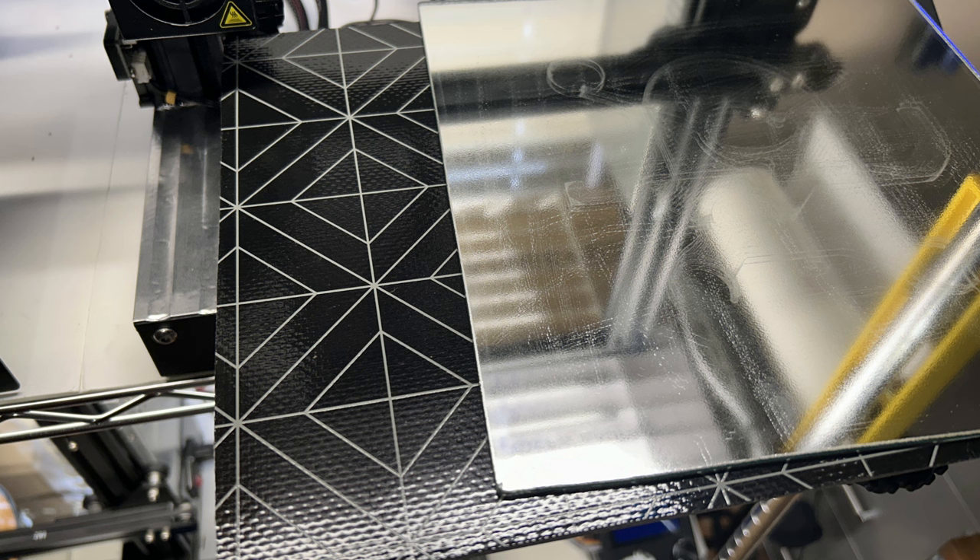Here's the tip I promised. I don't print at extreme speeds — I use PETG with a 0.8mm nozzle and 0.4mm thick layers, so I can't really print high speeds on this printer anyway. It's an Ender 3, not really designed for high speeds. I print at about 50 millimeters per second on PETG, but laying down those types of layers with wide lines the prints go really quick.